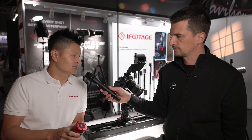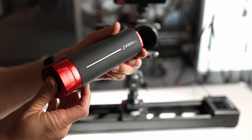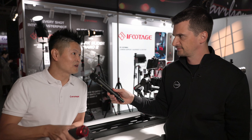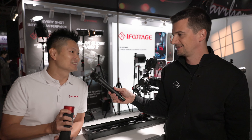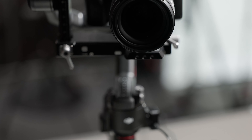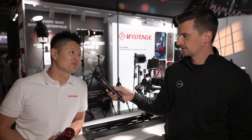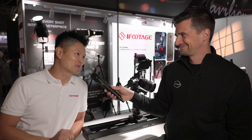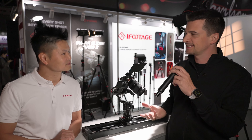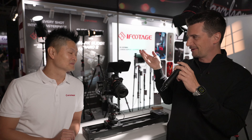There's a battery here, and I should mention this is the longer version — there's also a shorter one. With the Nano 2 we have two lengths: this one is 660mm physically with a 40cm travel range, and the shorter one is 440mm with a 20cm travel range. It still supports NP-F and Sony batteries. We also released a new battery grip — an optional accessory — that acts as an all-in-one power solution for the slider, the gimbal, and the camera simultaneously with just one cable. It's USB-C with 140 watts of power, so you can even power a 130W light. Yesterday we ran the whole show all day and only used one bar out of four.